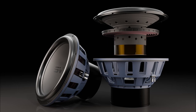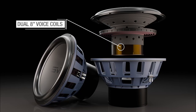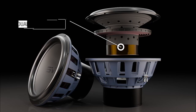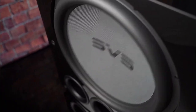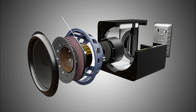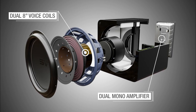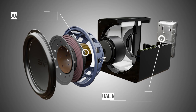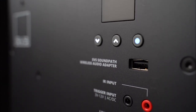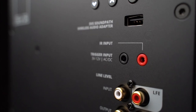We started rebuilding this new flagship driver around a dual 8-inch voice coil. There are actually two voice coils wound together — what's called a bifilar — around an 8-inch voice coil. That 8-inch voice coil gives us tons of control and linear excursion, and that is what works in symphony with this new amplifier. The new amplifier is a dual mono design, meaning an amplifier on each of the voice coils in the dual voice coil design. There has never been an amp more powerful than this in a consumer audio subwoofer.